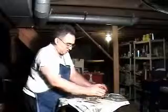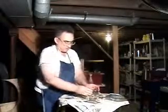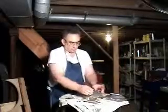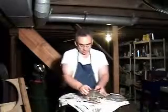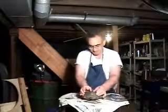Now as you will recall, when you're working with the tool or the pitch lap on top, you're working the edges. When you work with the optic on top, you're working the center. So right now, this is a convexing stroke.